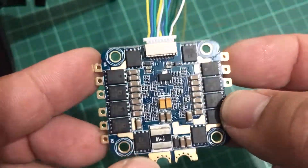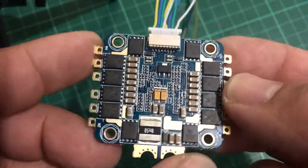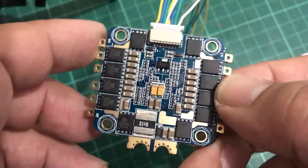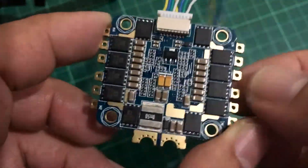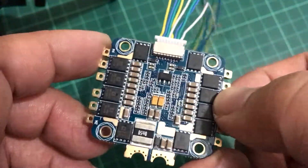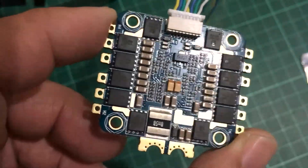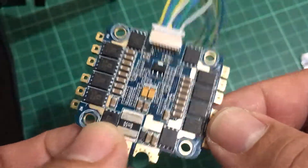The following four wires are for motors one to four respectively. This also runs BLHeli S, which means you can use turtle mode with this ESC. So if you flip your quad, you no longer need to pick it up in some cases — you can just flip a switch on your Taranis, use turtle mode, and try to flip your quad right-side up.